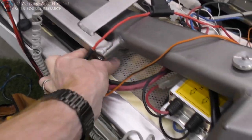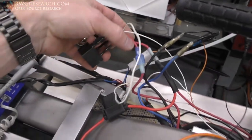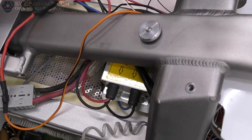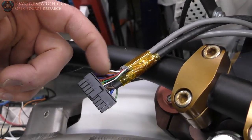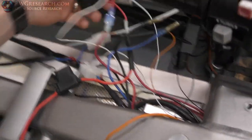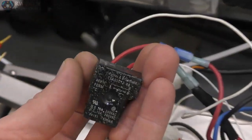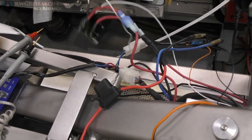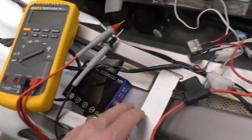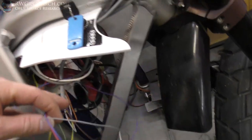The USB connector goes to my battery - that's how I'm getting the data and turning on the BMS. Then there's a relay down here to keep the 12-volt power local. I couldn't really run a big enough wire with enough amperage into this plug through the circuit back out, so they actually originally did this on the bike - this is the original relay that was on the bike. Using the same method, so I thought that works. The DC-DC converter is sitting up here.